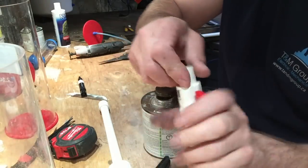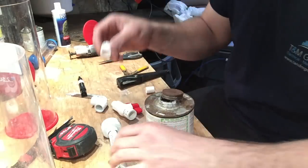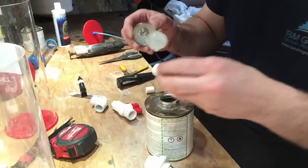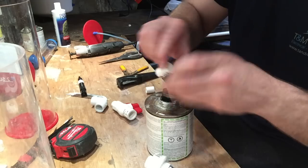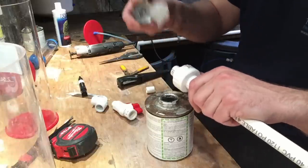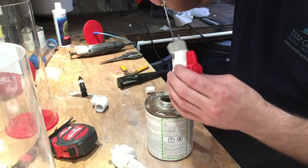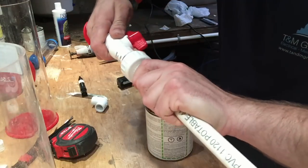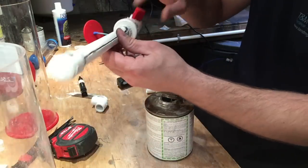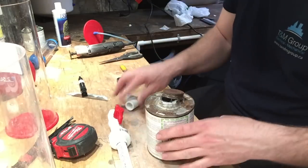Now we're going to pull out the piece we stuck inside the ball valve and glue it properly. We're going to glue our little piece into the ball valve — put some glue into the ball valve area, then a little bit on the pipe piece, shove that in and give it a tap. Next, glue up the union-to-ball-valve connection: put a little glue on the ball valve and on the pipe piece, shove that on and give it a twist. Just wipe away any excess. So now we've got the ball valve and union fitting all glued, and the end cap glued. Next we're going to add the 90 to the other end.